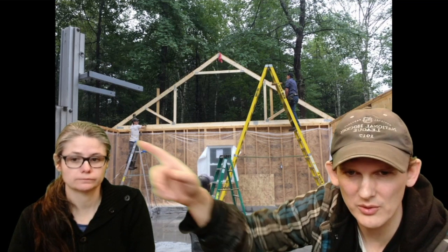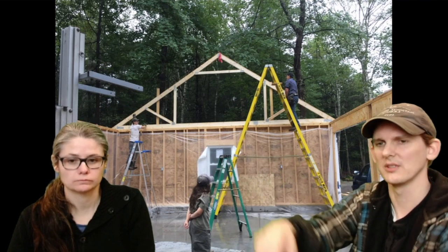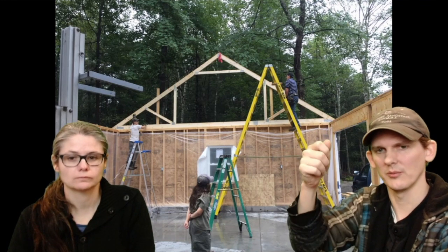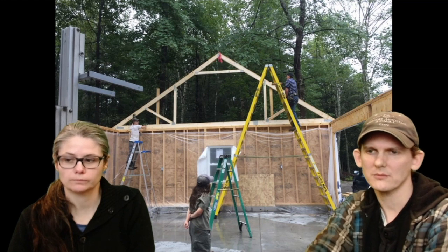And you can see over here, we'll see in later pictures, we had some hurricane brackets we just made to hold these things at exactly the right size and location, offset by every 2 feet, and we just lowered the trusses right into it. Oh yeah, so you can see the reinforcement bar right there that they put in.